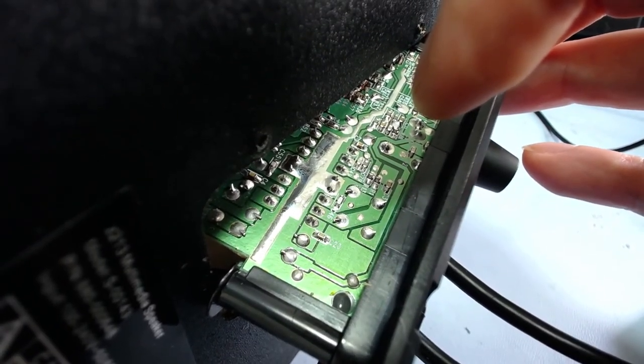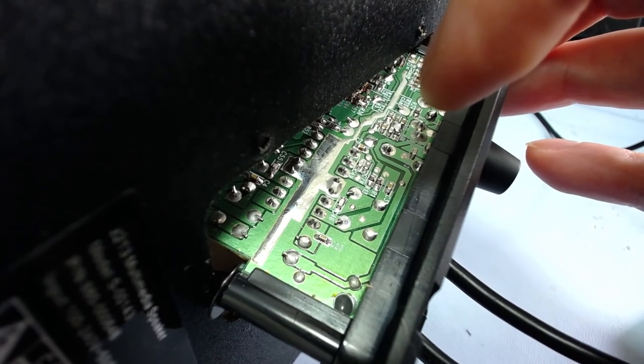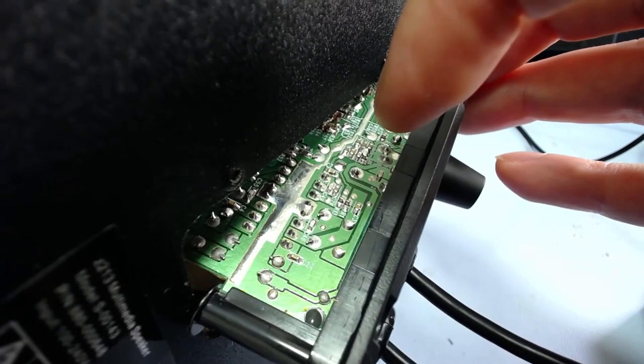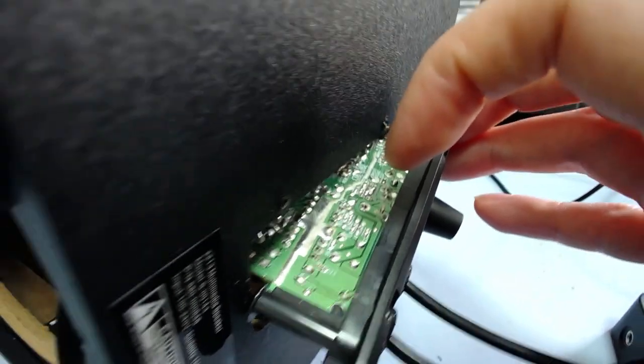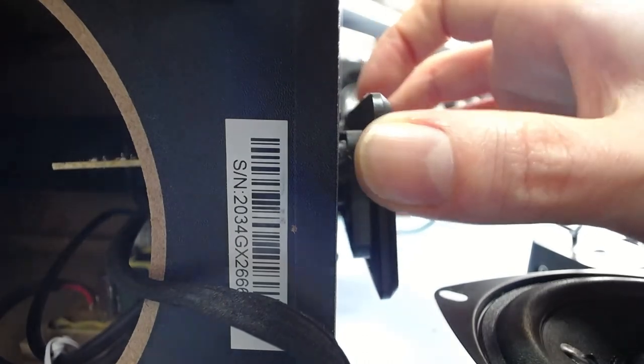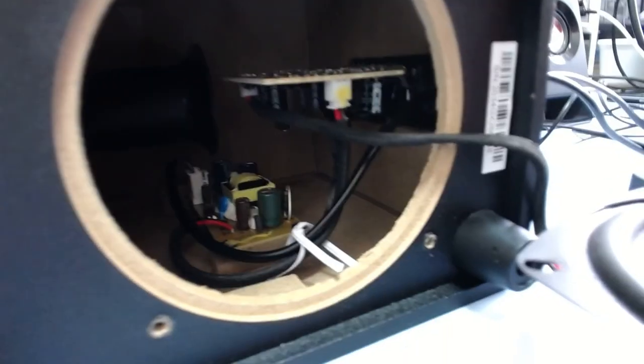It's also got, interestingly, the center two pins on each side all bridged together, so that could be heatsink pins. So, I don't know if that maybe is the amplifier there. I imagine they'd have two separate amplifiers, possibly a two-channel one to power the front speakers, and then another separate one to do the subwoofer, which makes sense because you've got different frequency requirements for that anyway. But yeah, I can't see any coils on the output of that at all, so it looks like this whole thing may well be just a standard linear amplifier, just a low power, high efficiency chip, heatsinked to the board in one case and with its own little separate thing in the other.